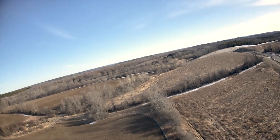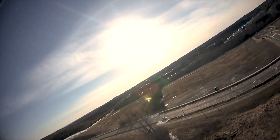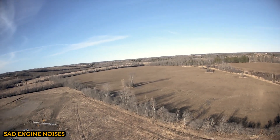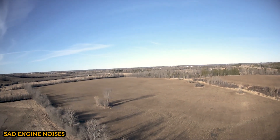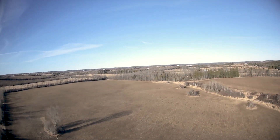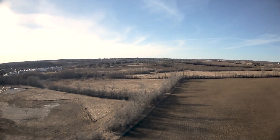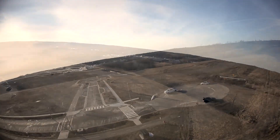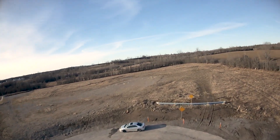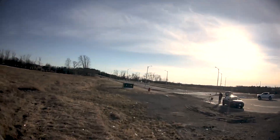What I wanted to do was extend the amount of time keeping the plane in the air with low throttle, but that was getting to be a greater and greater challenge as time went on. Once it got under 3.2 volts per cell, I couldn't gain altitude — I wasn't losing altitude, but I couldn't gain altitude either. The motors just weren't really able to work with the voltage I was feeding them. I kept the plane running a bit longer, and by the time I got to about 19 minutes and was down to almost 3 volts per cell, I decided to land. I was trying to get down to 2.95 volts per cell for that extra capacity, but I realized that just wasn't going to be a possibility. So I brought it in for a landing.